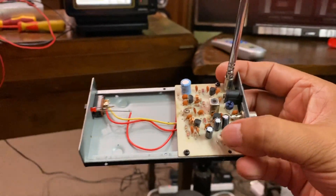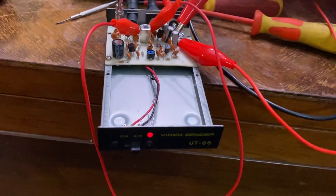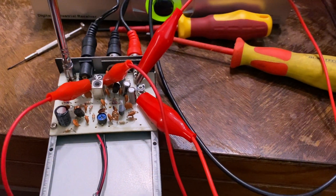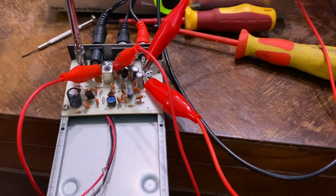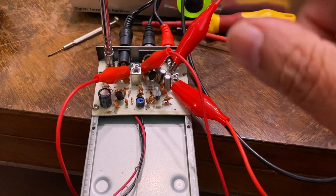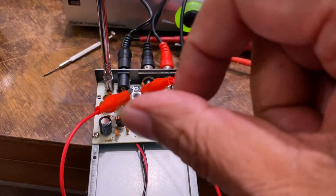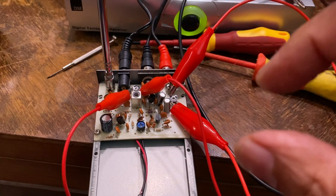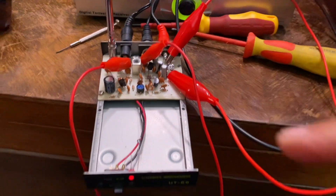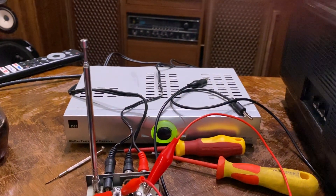The reason I think that is because with the second unit, I've actually bypassed the audio volume control over there — it's just been shorted out. The pot is set at max and the video gain one over there is shorted out at max. I'll just solder those in tomorrow. With the audio gain and the video gain set to max, I'm feeding a signal in from an old set-top box.